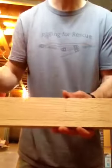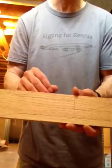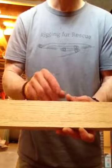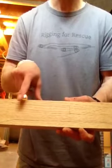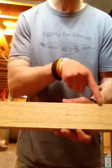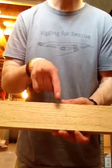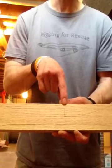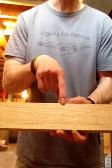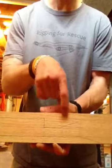Cut your length to 66 inches, and you can tweak that depending on your own sketch and layout. Find your center line. 4.5 inches out to either side becomes your handle section. 1 inch above center is where my arrow rest is going to be, or I should say, the beginning of my arrow shelf and sight window.